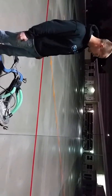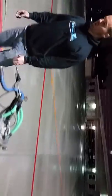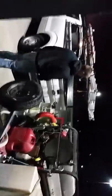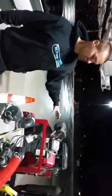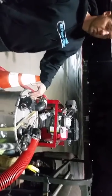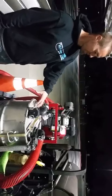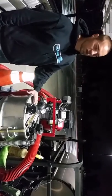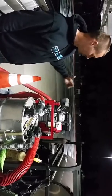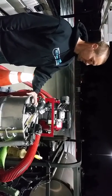We're able to reclaim 100% of the water. It comes up through here, follows this vacuum hose here, which we're capable of doing 200-300 feet into the vacuum itself. It comes into the first drum then makes its way over to the second drum. Here we have two drop-in filters and also a screen mesh. This eliminates just about all the heavy sediment materials as naturally they settle to the bottom. So it technically goes through four levels of filtration here, and then makes its way out to our pump out here.